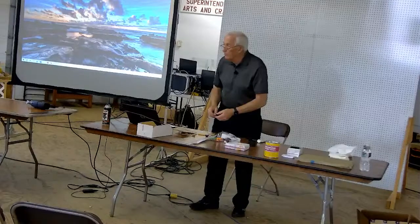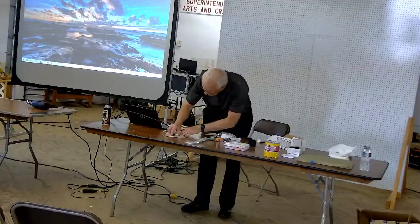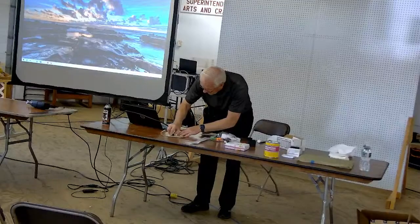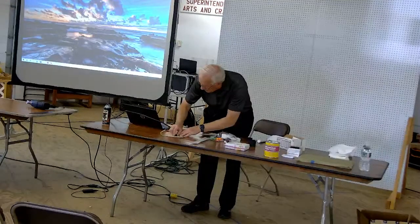Two-sided circuit board can be used — a little tape on the edge protects the knob when you're rubbing it on the surface. I take some 180-grit paper underneath. You want to keep the knob as close to the edge of where the circuit board is, otherwise it's going to bevel at an angle. As you bring it down to size, make sure you're close but not enough that you'll rub the edge against the white marker. You can hear the knob starting to rub really well on the masking tape.